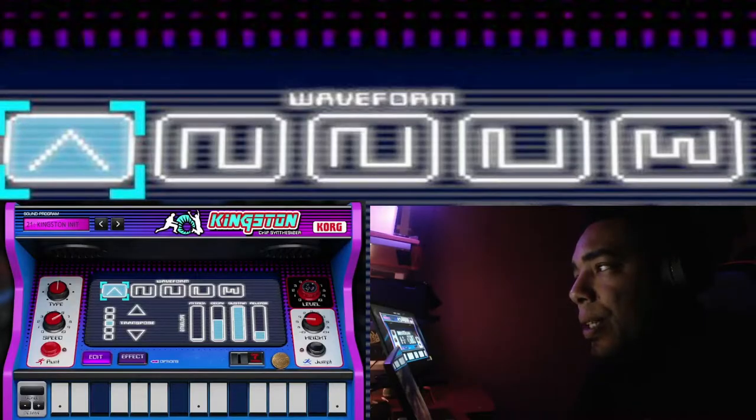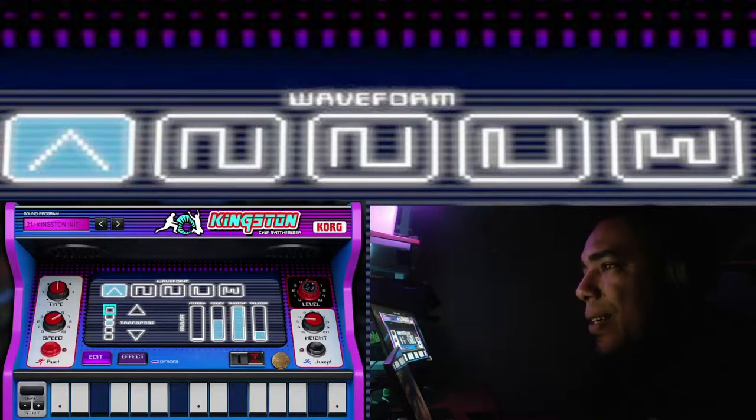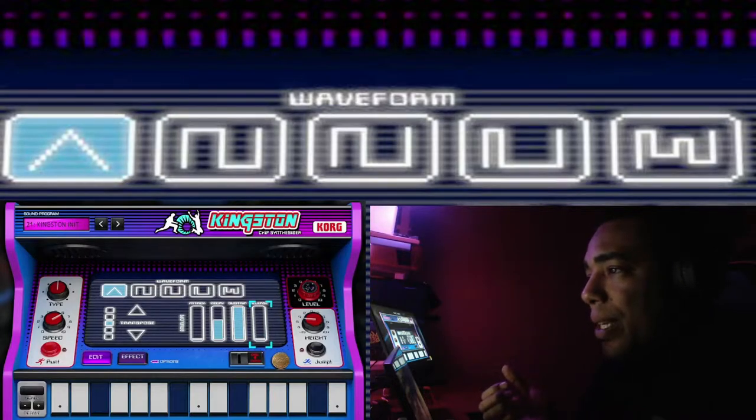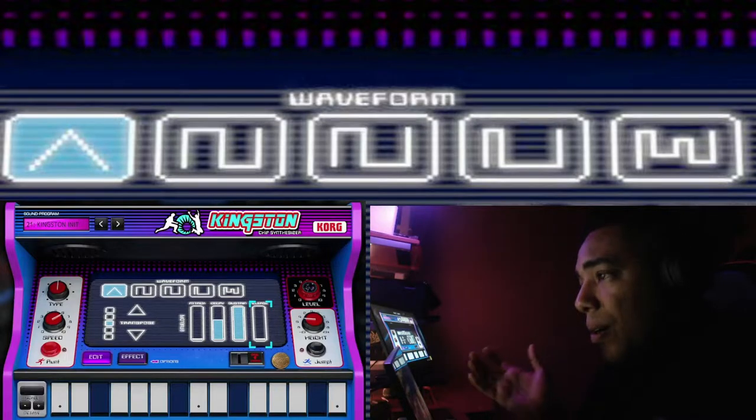That is used on the NES mostly for bass in games. It's just a simple triangle wave. It can't be shaped into anything else. Here on the gadget, you can do a release like so. But you wouldn't hear this in an NES game. There is no release. It's either on or off. That's it.